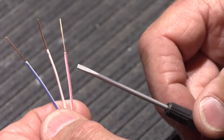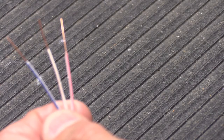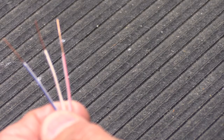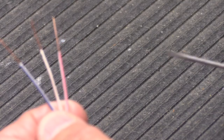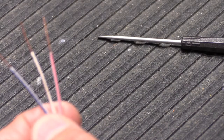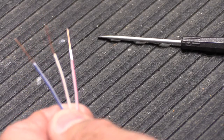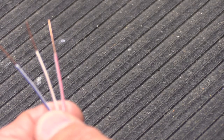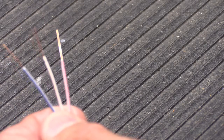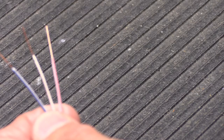When we strip back this 1990s wire, we find a difference: the silver wire is gone. They eliminated the step of coating the copper wire to make it silver, so now we simply have three copper conductors — red with copper inside, center (always copper, always center), and blue with copper. We're now relying entirely on red, center, and blue. The screw terminals on stations may still say red/silver, so be aware that red and silver refer to the same conductor.